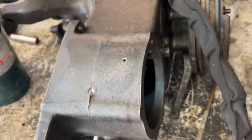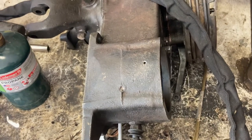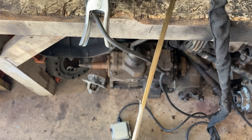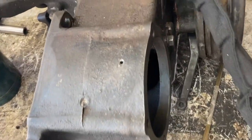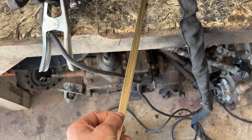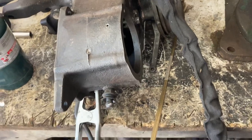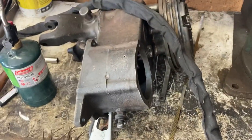So this is cast iron. I've only done quick get-home fixes on cast iron before, so I'm trying something new today. I bought this really expensive TIG filler rod on eBay because I have to fix a broken intake manifold, so this will be a good test run — all we're doing is filling in this hole so water doesn't get in it. This is an aluminum alloy, like an aluminum bronze, so we're going to weld on AC and kind of try to use the cleaning effect to get a little cleaning action. I'll get set up and see how it works.